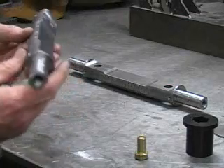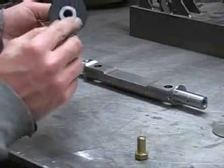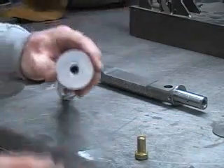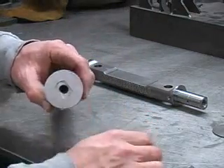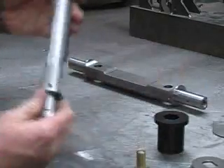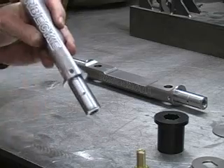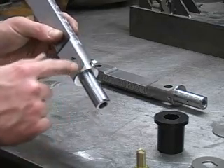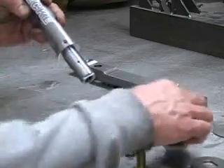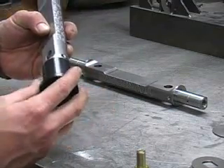What we have here is a piece of inch-and-a-half round stock that's been CNC machined. We've turned the edges down to accept our polyurethane bushings. We've machined flats on the edges to accept the lock washer, which keeps the bolt from backing out as the suspension is moving and the control arm is going up and down. We've cut our name into it, and we've installed a grease feature that accepts a zerk fitting on top of the shaft in two locations — left and right. When you push grease down into that zerk fitting, it forces grease down and up through a hole underneath the polyurethane bushing. When the suspension is moving up and down, that spreads the grease throughout and keeps it lubricated and squeak free.